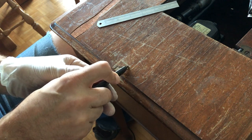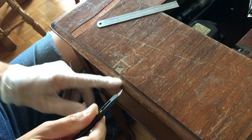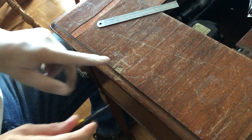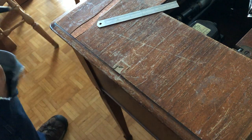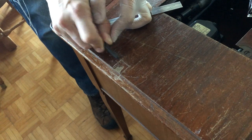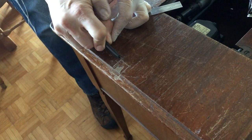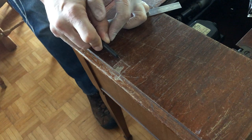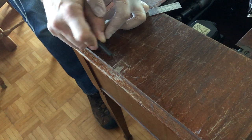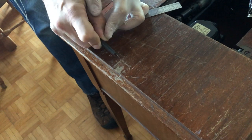I've not tried this technique either — I didn't really think about it until the viewer said, 'why don't you try squaring it off?' I'm getting a little scratch here, but I'm not worried because my restore finish is going to help hide that. I'm mostly concerned with not going past my square — although restore finish and my little filler crayons will help me correct that. I want these scoring lines to be straight and a nice clean break for the old veneer.